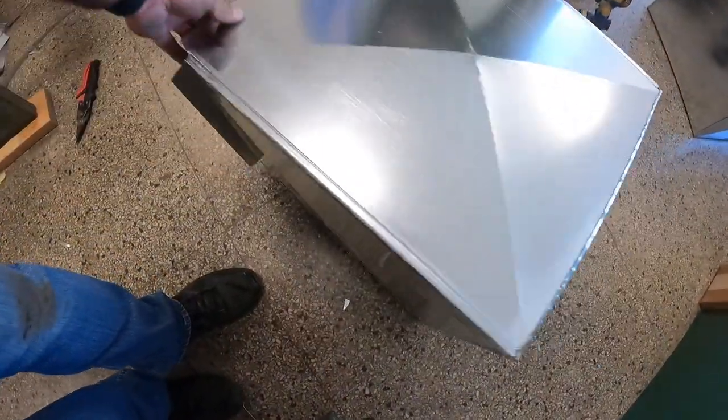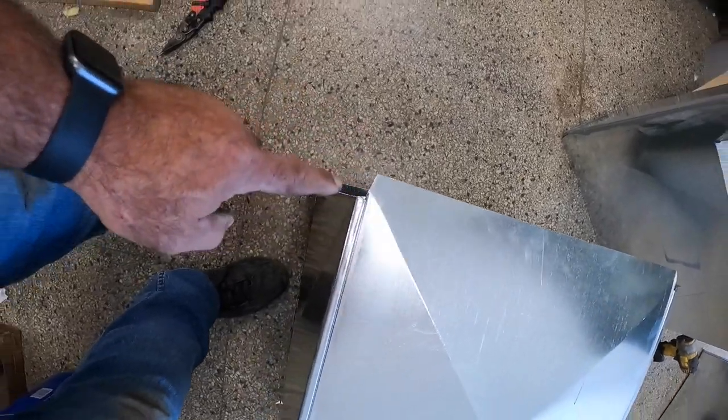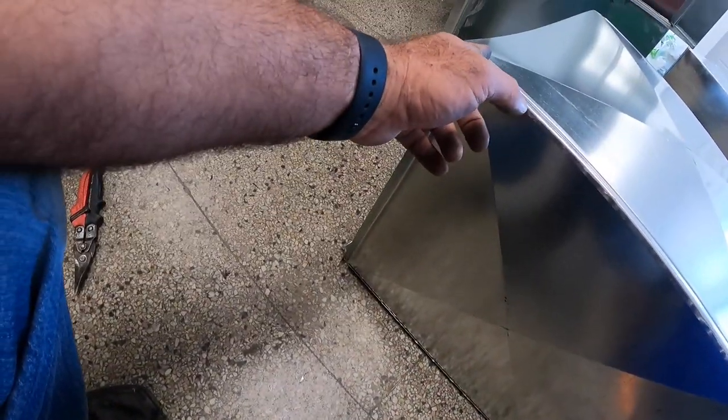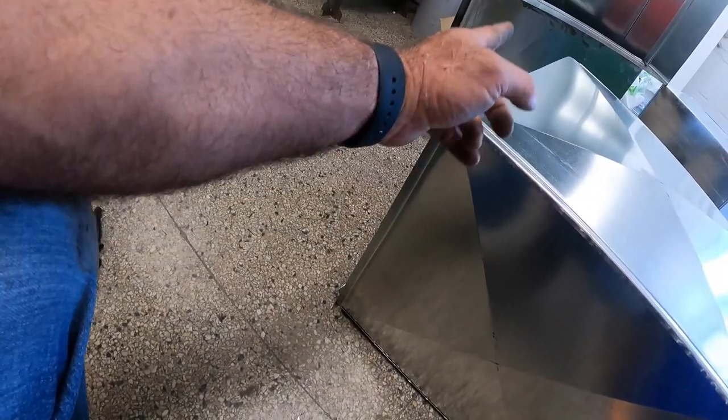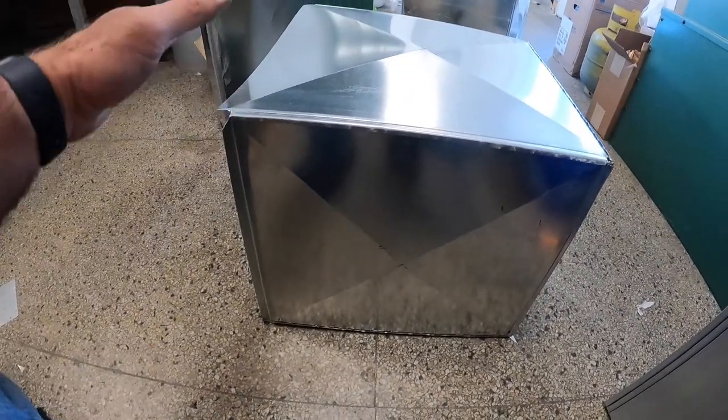And that'll be our plenum box. Again, these are bent out. These are going to bolt or screw to the bottom of the air handler. These will screw into the side of it. I did that because I needed the height. If height wasn't a concern, I'd have probably gone ahead and made the thing 2 inches shorter and bent them up here as well. It makes the insulation finish out more flush with the top of the unit.